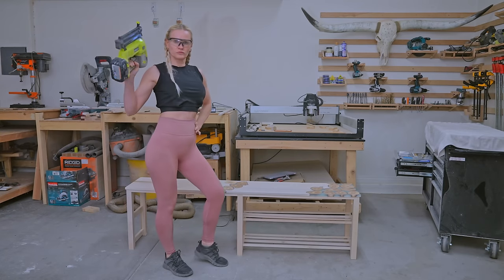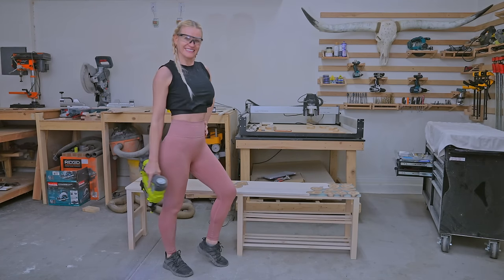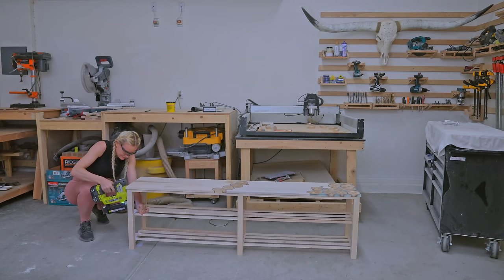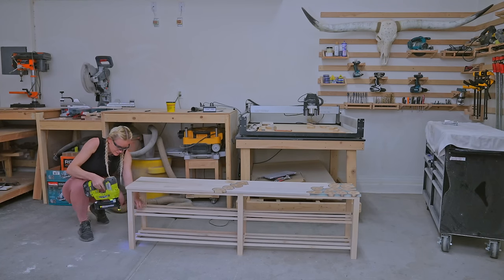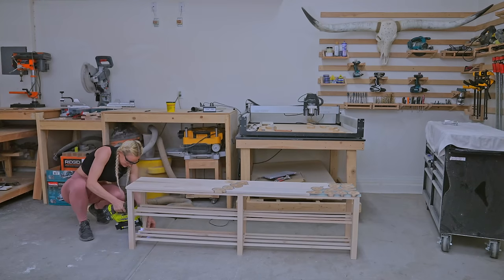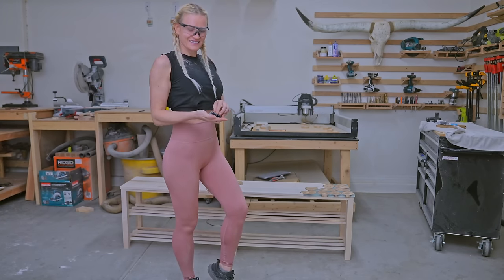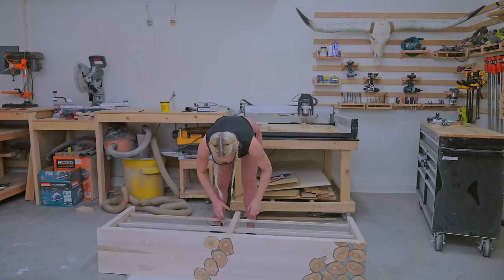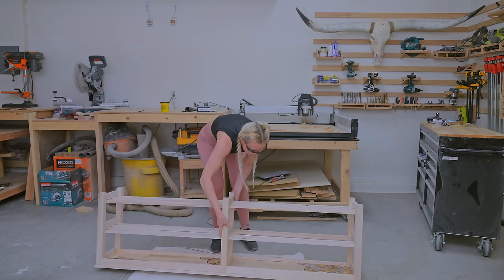And next up is this cool tool, my brad nailer. I will use this tool to add the slats that the shoes will sit on. Simply add a nail to each corner. This will hold the pieces in place. I've decided to add some furniture legs to the bench. Therefore, I drilled some holes to attach the little legs. The legs are fully adjustable. Like always, the link to the product will be in the description below.